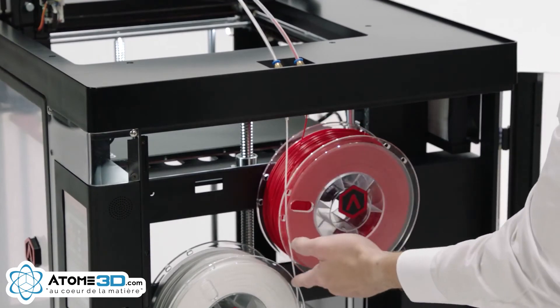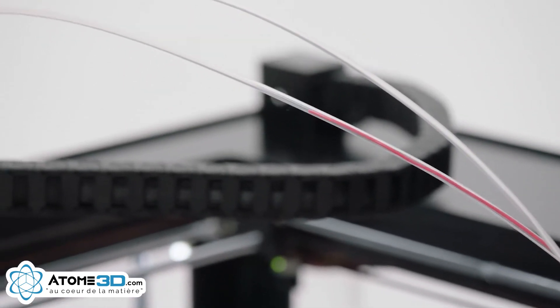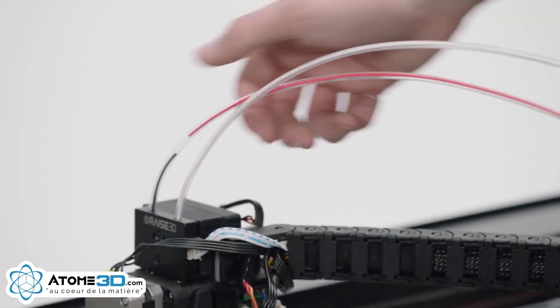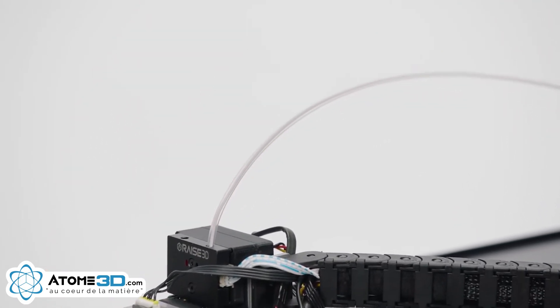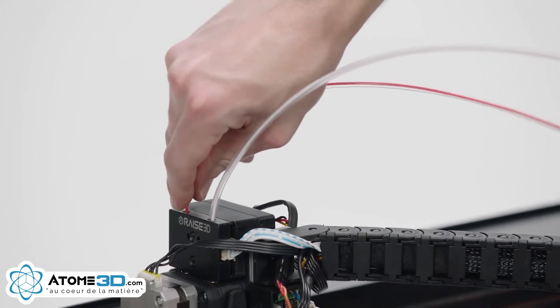The filament spools feed toward the center. Manually feed the filament all the way through the guide tube. Remove the temporary guideline and feed the filament into the printhead, then slide the guide tube back in place.